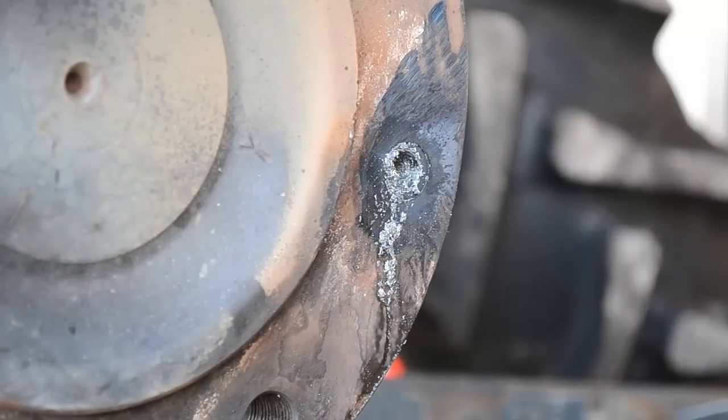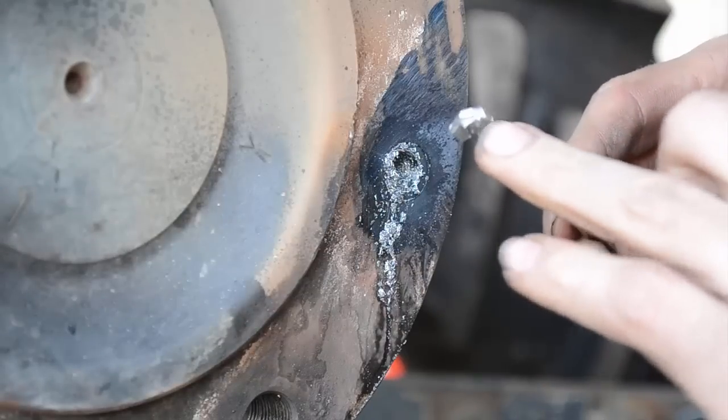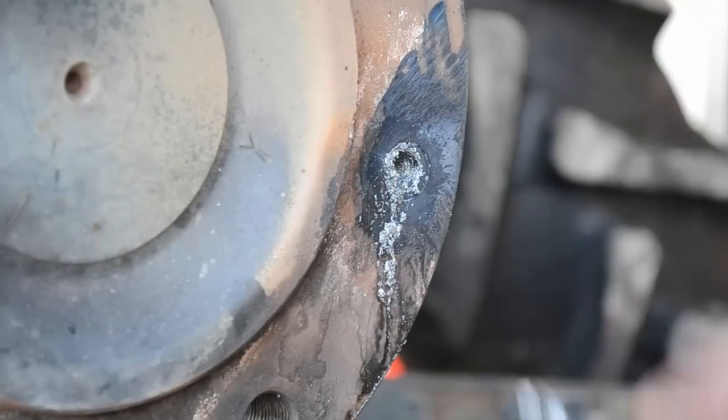We broke our bit. Chipped it on both corners. I'll let you look and see. They chipped it right there. Yeah, carbide doesn't like an interrupted cut. I imagine it didn't hit hard at all and it broke. We're through all the way to the other side. I just had to knock it out or something. Whew. All right.